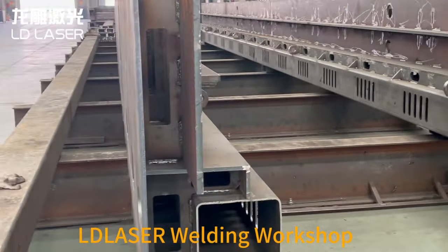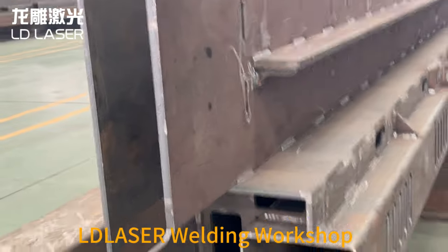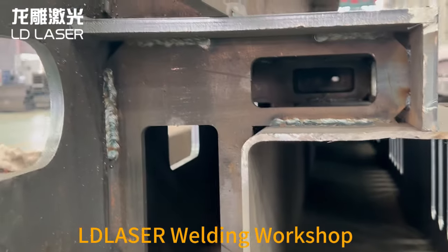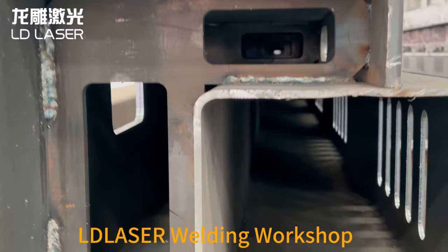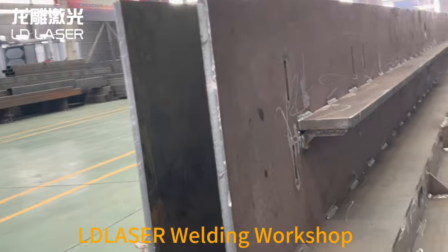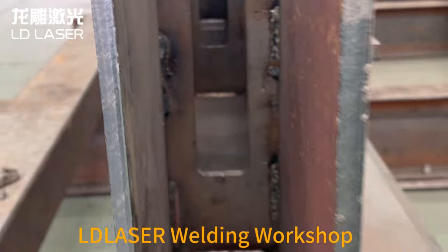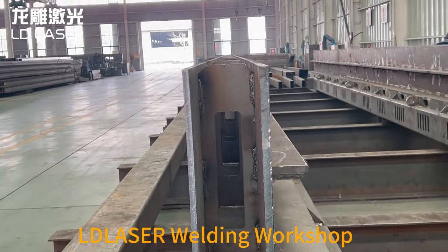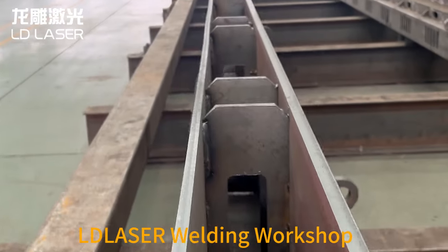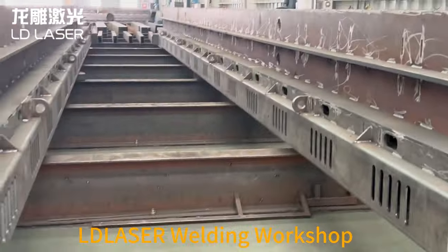But you can see from here our exchange table model machine bed. And over here, on the top and bottom of the body, we put some bones to make sure that over this long distance, they will not easily deform from long working time or heating. And on this side also, we put some bones inside to make sure the machine can work for a long time. One side and two sides.